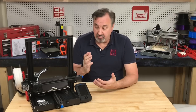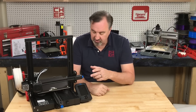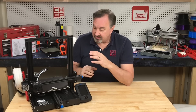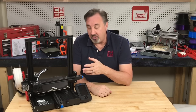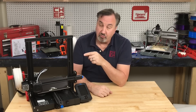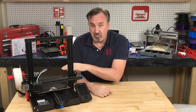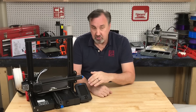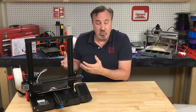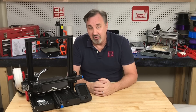Some people are wondering: can I do this on my Ender 3 or Ender 3 Pro? First off you need a new display — this is a full graphics display, and the Ender 3 and Ender 3 Pro don't have that. Second, you should probably upgrade the motherboard anyway because then you get silent drivers. If you go to the version 4.2.7 board which you can get aftermarket and put that in your Ender 3 with a new display, you essentially have the guts of an Ender 3v2, and at that point you should be able to run the firmware and get this to work.